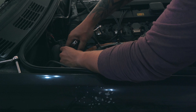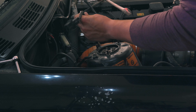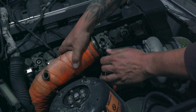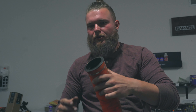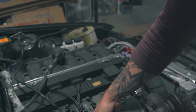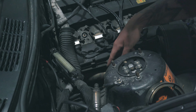On the C30, first things first, we're gonna pull off the old downpipe and then start making a new one. I'm going to reuse this v-band flange because that's the one that came with the turbo. I'm just gonna chop this and then make the rest of the downpipe. Looking at how close this one sits, we're gonna cut a little more and have it drop down through the hole nice and easy.